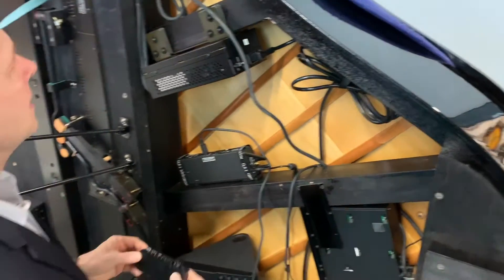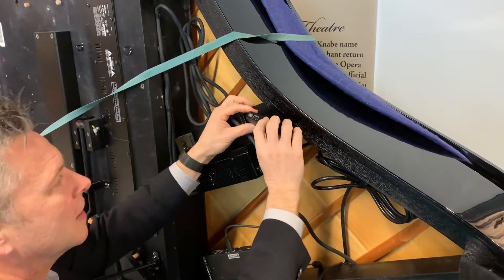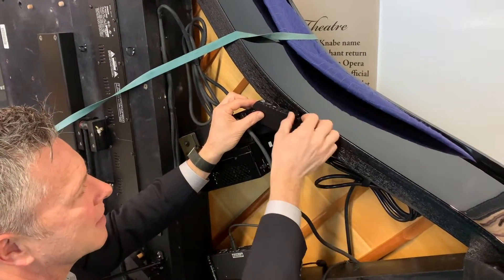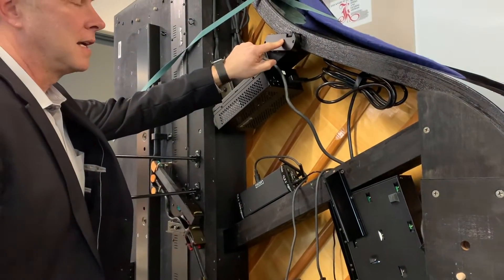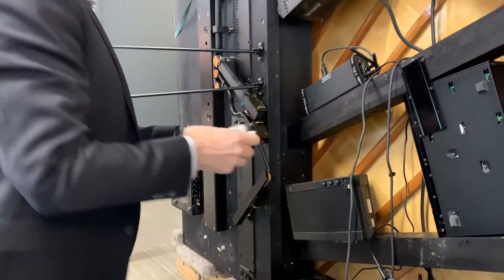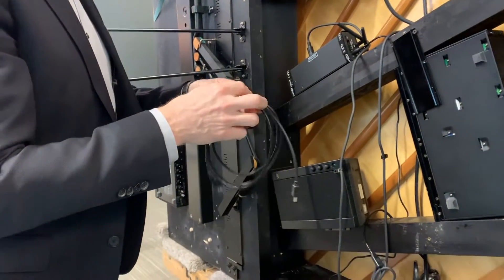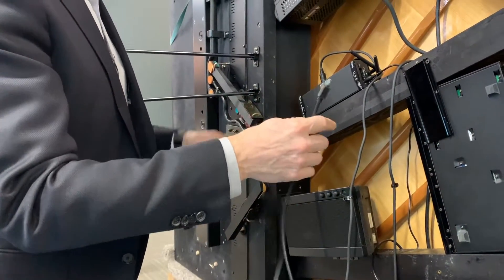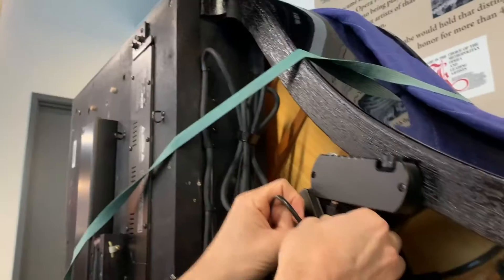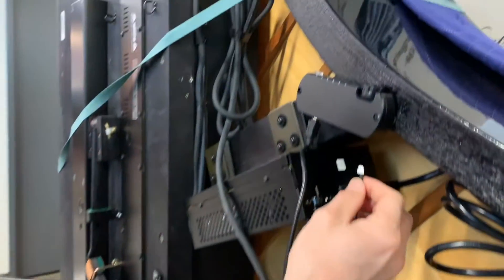Here is the PLX box — that's a start and stop button, and this is volume. To be less invasive, we're going to put it here so the customer at the hospital knows where it's at. This would be better here if we put it on the rim at a little angle. That way, if they use the remote control, the remote control eye is right there. The start and stop and volume are right here, so you don't need your device to work it. Now that we've mounted the PLX box, normally it goes on the front of the piano, but in this case for the hospital we're putting it on its side. There are two cables we definitely need in the PLX box — we could put five for recording and different things, but on this particular instrument we only need two.